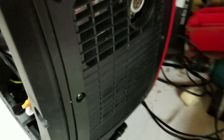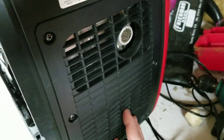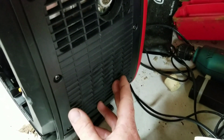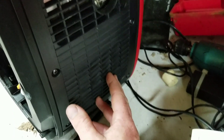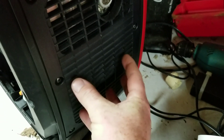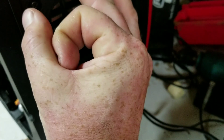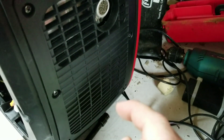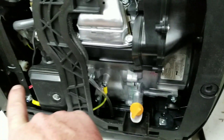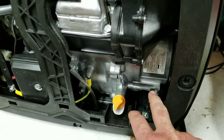If you take off these six screws — mind you, only after the warranty is already void — there's a little rubber boot that covers the back end of the alternator, and there's a tiny hole in there. Double the size of that hole to get more airflow going to the alternator, because that's what makes your electricity and that's also part of the inverter. That has a good possibility of dying on its own just from heat — heat is the enemy of that component.